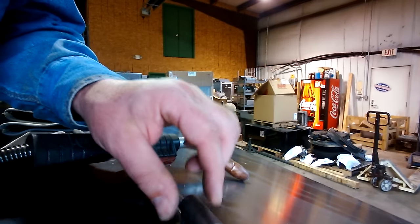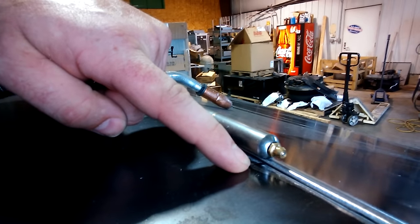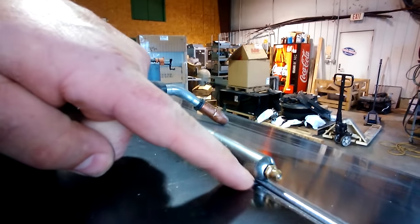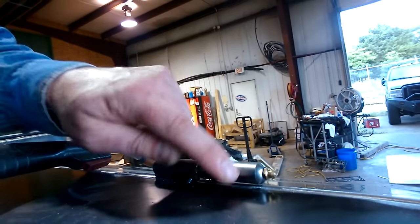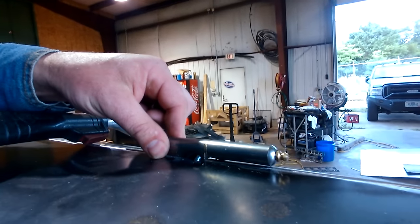What I do when I'm lining these up is I'll hold on to this part of the hinge and I'll have a mark where I want the grease fitting side. Once I put that grease fitting on that end, that also helps me get it adjusted left to right where I want it. Then I just hold this part up and you'll see there's a gap under this other part — that's to allow clearance so whenever you swing the door open, the door doesn't scrape all your paint off or make big scrape marks in the metal, and bind. So this also helps you find a good height adjustment.